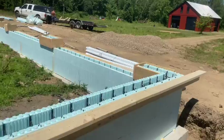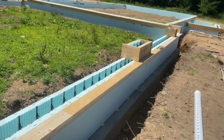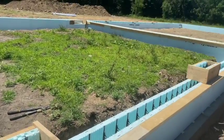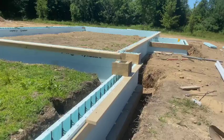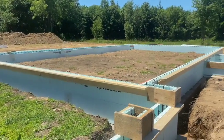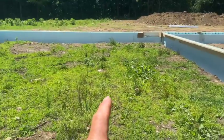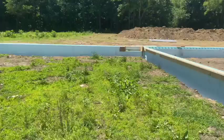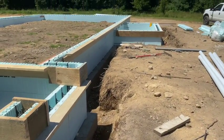I'll tell you how we did the garage door openings here. We just screwed some boards around them to hold concrete in place. We got that strong back board going on there to stiffen the wall. I asked the homeowner what he's using to frame his house and he's using 2x6x12s, so we picked up six 2x6x12s and we're just using them, then he's going to take them. We'll clean them good and he can still use them to build his house with. This all gets filled in right up to where that cut is, and then we'll pour a floor. There's going to be plumbing in there. The garage gets filled up to the top of this, then we'll pour a 4-inch floor on top of that. He can get a decent pitch coming out away from his house and garage.